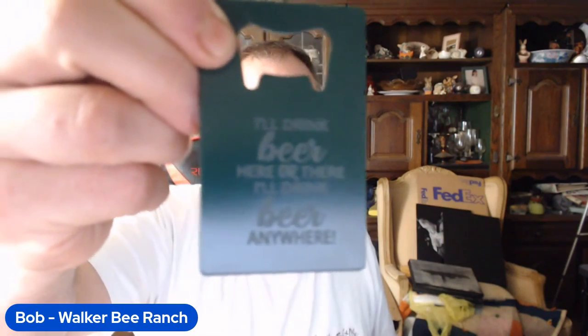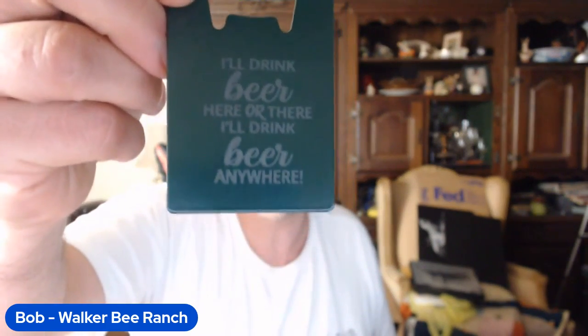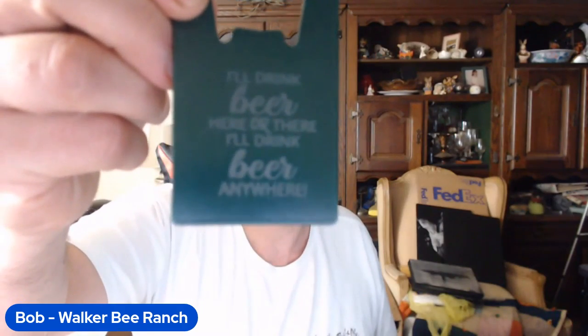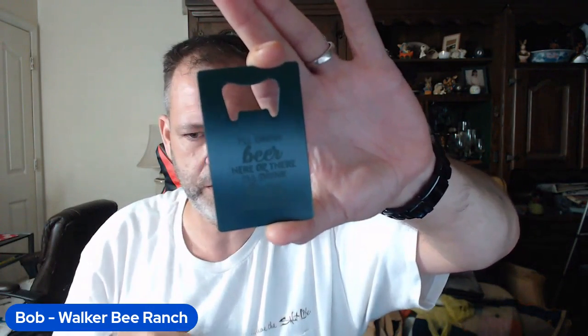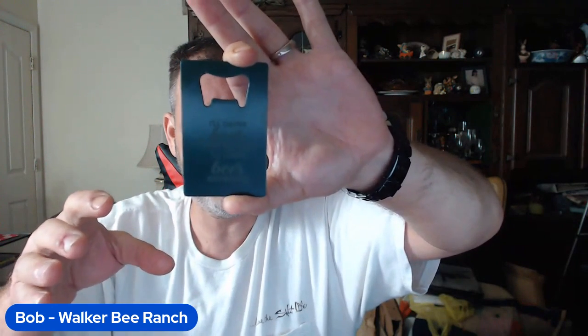It takes a little bit of time framing it up, but I'm sure this same process works, guys, if you're using wood or whatever, as long as you get it square to the machine. A lot of people that I see in the xTool group, it'll be cockeyed a little bit, and that's because their X gantry is going this way, or it'll be straight for a while, they're batching and doing a few, and then all of a sudden it starts to turn. That's because the item they put on there has either moved or they've bumped something. Like if it's on a tumbler, they've moved the rotary and it's not square.